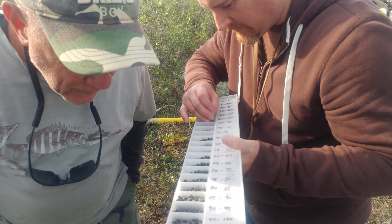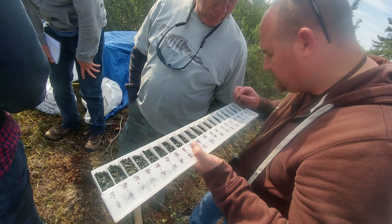What I've been doing is marrying different technologies. Not only are we RAB drilling, we XRF the powder, which gives me the metal content as we're going down the hole — done live. At the end of the day we run a downhole televiewer, putting a probe down that gives me an oriented picture of the walls of the drill hole. I splice that with the XRF and you can actually visually see your mineralized zones — and get that answer before midnight of the same day of drilling, versus the six weeks to two months it would normally take.